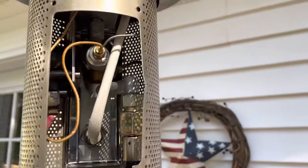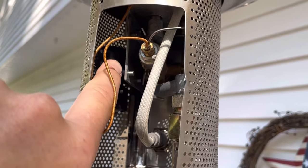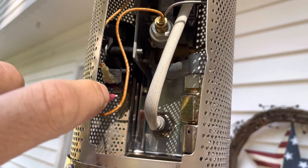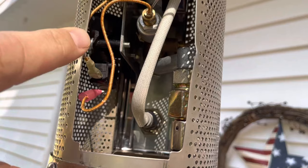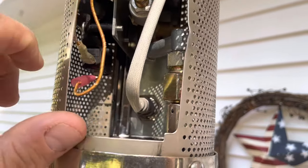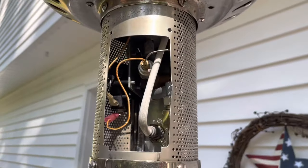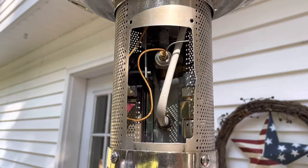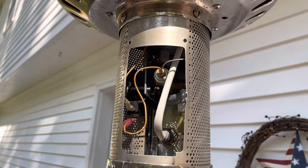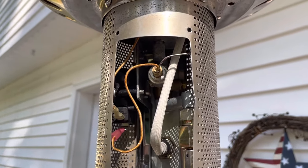Next, let's talk about the thermocouple. You can also have a bad tilt switch, which is right here. Some people bypass it by just connecting the wires together, but I like keeping the tilt switch. One of the connections was a little loose, so I put a new crimp connection on there — now they're nice and tight on the tilt switch. This operates very similar to a RIO switch on a John Deere tractor, the button you push before putting it in reverse to keep the blades engaged.